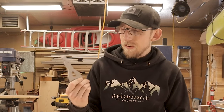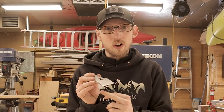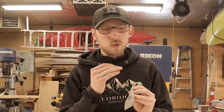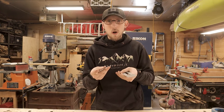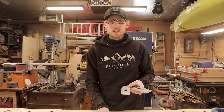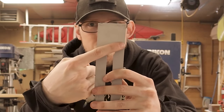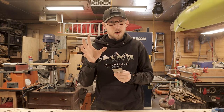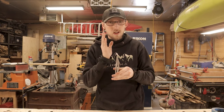The lever cap, unlike a lot of the other Stanley planes I have, is just straight steel. When you sandblast it, it gives you a nice clean, smooth surface — you can even tell the edge is hardened because it actually doesn't take the sandblasting that much. So really all we did was knock off any surface impurities and we're left with a nice smooth finish we can go straight to polishing. Then on the blade and chip breaker, we're left with a fairly rough finish because I'm using 60 to 80 grit blasting media. What's really interesting is on the blade, you can see exactly the difference between the hardened portion and the soft portion — there's that line where the backside was obviously hardened. The sandblasting really doesn't make that big of a difference on the hard steel, but on the softer steel it adds a whole bunch of texture. You can see exactly the difference between hard and soft steel in the blade.